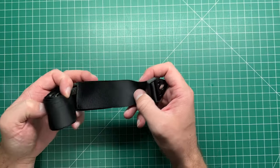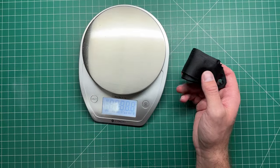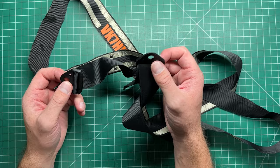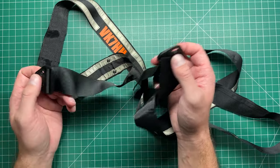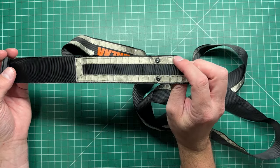You've got an antenna that's elevated off the ground — run some coax to it and away you go. I'm just going to measure how heavy this thing is. In grams, it only weighs 36 grams — for my US viewers, that is 1.27 ounces. Ben does note that if it's not straight and blows around in windy conditions, the signal can go up and down, you can get some QSB, and the tuning might be affected. But if you keep it nice and straight, it should work a lot better.